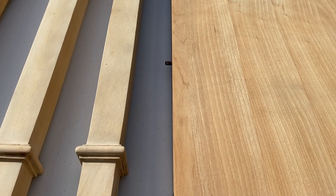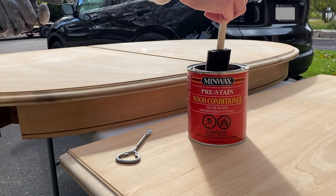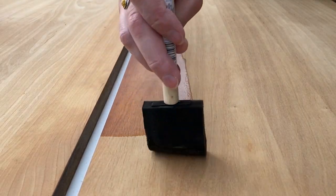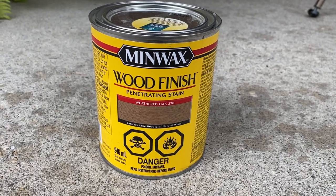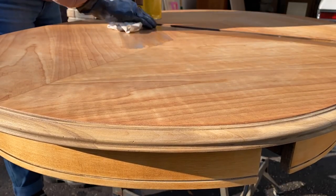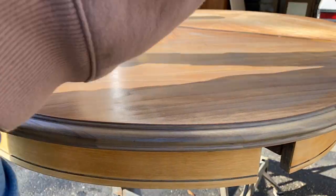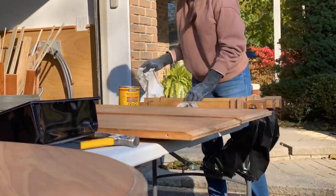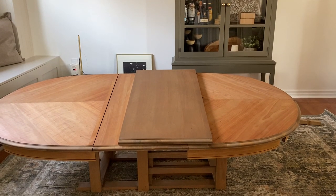I'll admit that I was afraid to choose a new finish. I had gathered a few inspiration images but wasn't exactly sure what kind of wood my table was made out of, and was afraid that I would hate what I chose and have to do all the stripping work again. Before applying the stain, I used a wood conditioner to ensure a smooth application. This product and the stain I was planning to use were both oil-based, so they pulled out a lot of the orange and red tones from my wood. I applied the stain — Minwax's Weathered Oak, which has a grey undertone — to the entire table using a cloth, building up coverage with multiple light coats. But the more I added, the more obvious the different types of wood appeared to me.